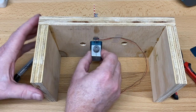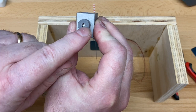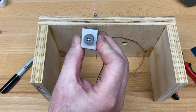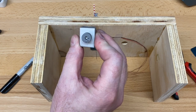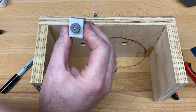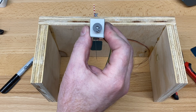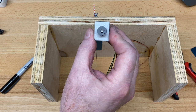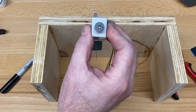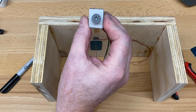The next thing is that on the motor, you can see that the dot that's closest to the center is at about the 90 degree position. So one of the functions in the motor controller is to raise this back to the top. It really just turns it counterclockwise. It's three pushes of the button, and I'm going to do that now. And you can see that the motor is turning counterclockwise, and we want to stop it with one button push when it gets right at top dead center, which is right there.